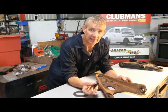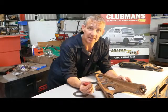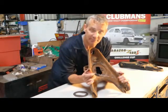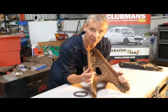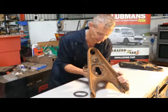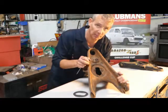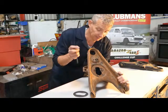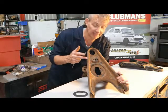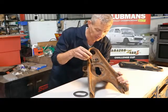There are very few areas on the Volvo 140 that we actually bother strengthening — it just doesn't need it. However, one of these is the lower wishbone. This here is the wishbone from the London to Cape Town Rally, right at the beginning of the Ethiopian section. What has happened is this 3mm spring plate has a couple of captive nuts tack welded to it that support the shock absorber bottom mount, and these simply fatigue with the rapid oscillation fatigue that we get on a tough rally like the London to Cape Town or the Peking to Paris. It simply cracks around the two captive nuts.